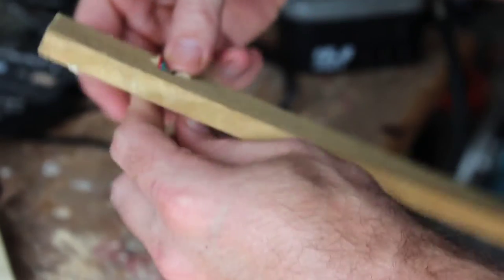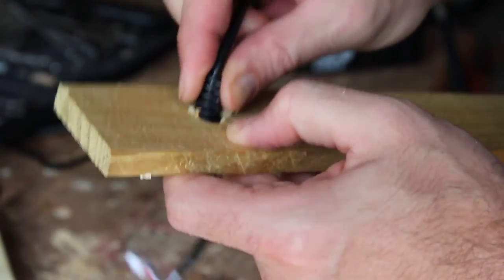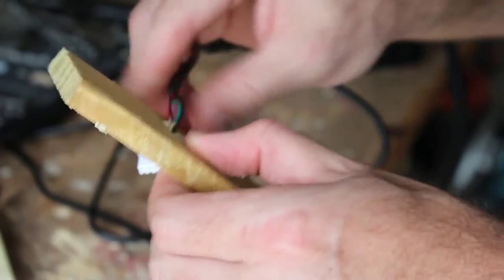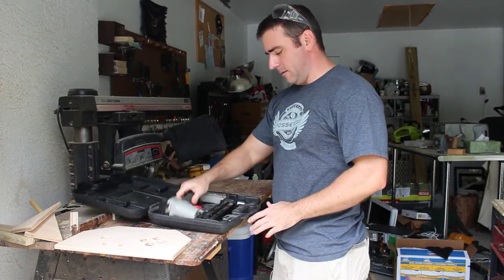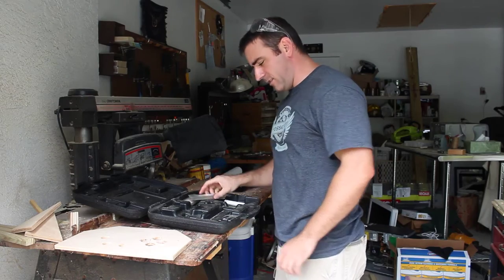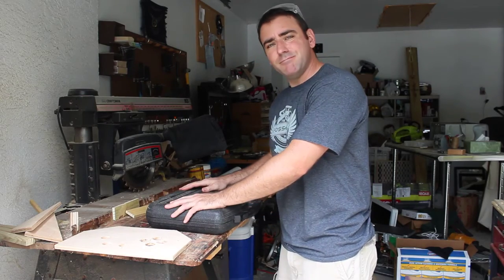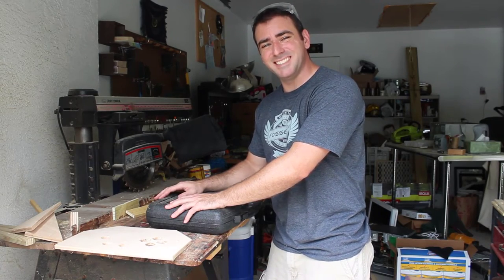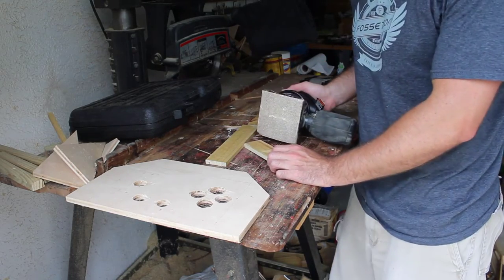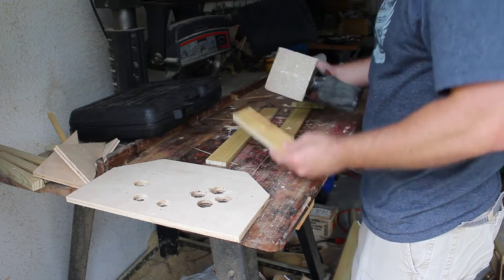It's not the prettiest hole in the world, but it is big enough for the connector to fit through and for the plug to fit in. A little hot glue when I'm done will help hold that in place. Now for the fun part — I'm going to break out the brad nailer and use one-inch nails to nail all this together. If you don't have a nail gun, you can use regular nails, screws, or even glue. I'm using the nail gun because this is being given to a four-year-old who's going to be pretty rough with it, so I want it as sturdy as possible. I probably should sand down some of these pieces before nailing them together — it'll be easier before they're shaped like a box.